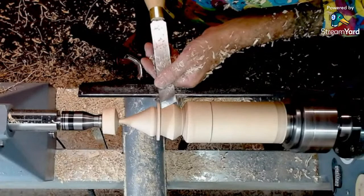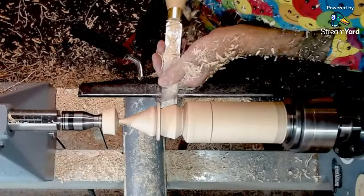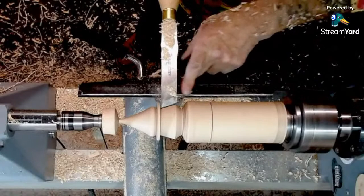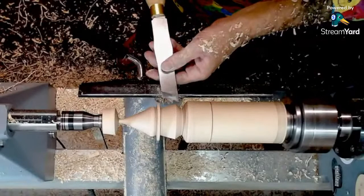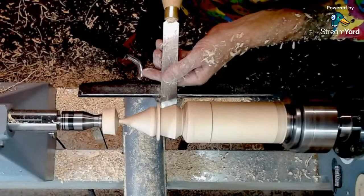That's it. Well, if you look at somebody's head, it goes straight up into the hat. They've only got a round chin at the bottom. Doesn't go up in a point. You're still going at an angle. Turn the skew over. So you want this 90 degrees here? Yes. Turn the skew over. Take the head down to the width all the way straight, then turn the chin. So you're going to do a half bead at the bottom for the chin. That's all. The rest of it's going to be parallel.